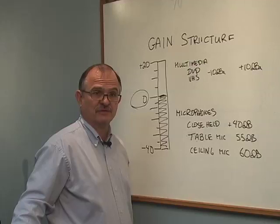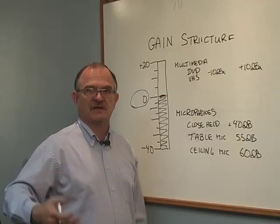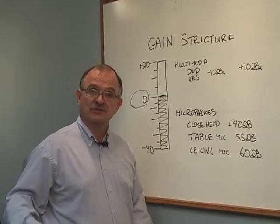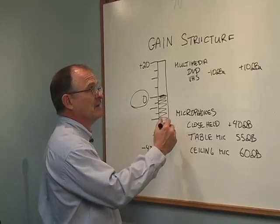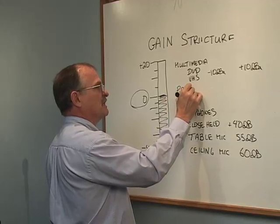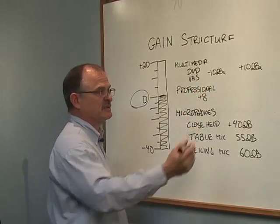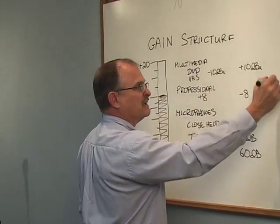When you're testing the microphones, don't sit in front of them and robustly go, test 1, 2. Talk like someone who's typically going to be in that room. Usually it's an untrained, non-professional person who has no concept of what microphones do, and they'll talk in a normal, softer voice. So they'll talk loud enough for the closest person to them to be heard. On professional audio equipment, such as mixing consoles, where it might be as much as plus 8 on their outputs, and if you're bringing that into the processor, well, then you might want to set the level to minus 8 so that it equals 0.